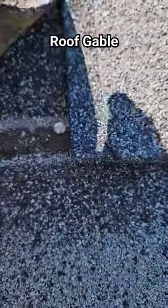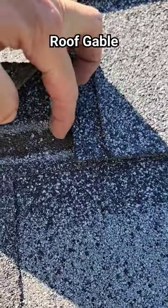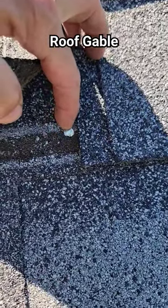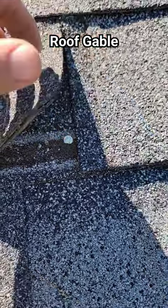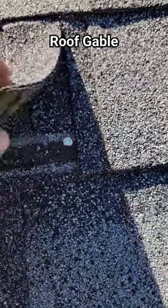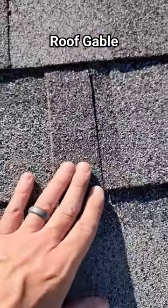What you want to avoid is what you see right there. Over time, water will get in around this zinc-coated or galvanized nail, it's going to rust out — typically about four to twelve years. That'll create a small penetration where water tricks in. It's a hard leak to find, but it will definitely cause a problem.